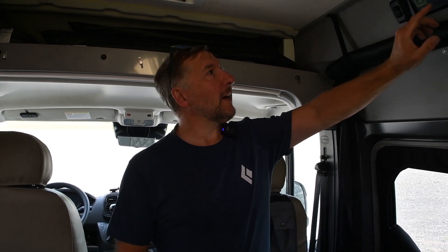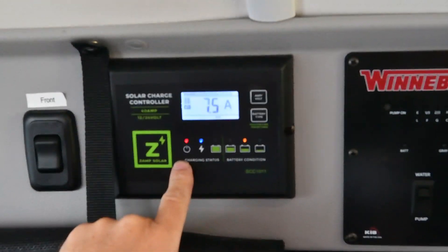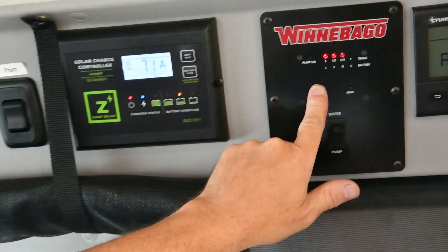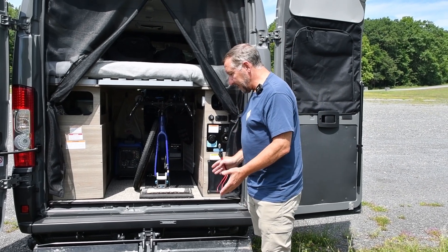So this is where we sit with the standard solar panel only. The sun's not really directly overhead — it's back a little bit — but we're getting about 7.9 to 8 amps off that one solar panel. Right now we're back up to two-thirds. I was at one-third earlier, so I'm hoping during our ride, by adding the extra solar panel, we can get this back up to 100%. Okay, I'm going to hook up the panel — it should be pretty fast and simple.